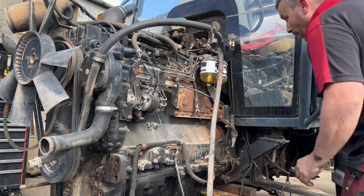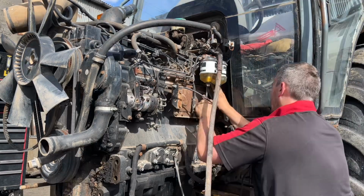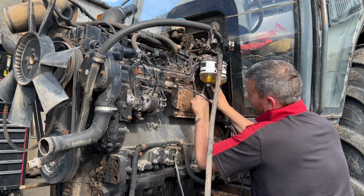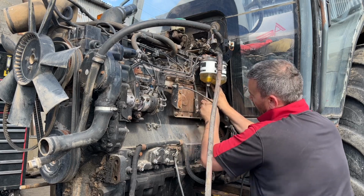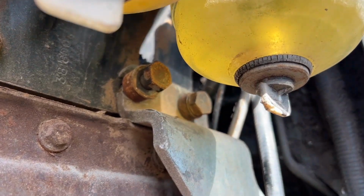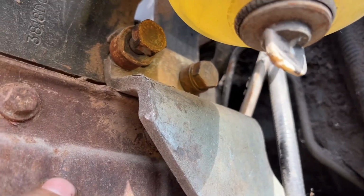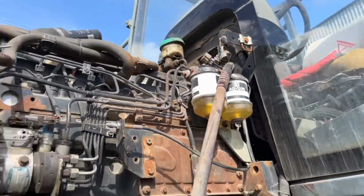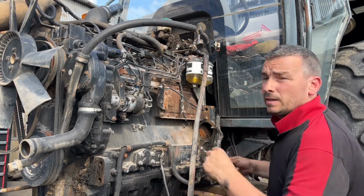Right, we'll take off the bracket here, I suppose. The 17s. Whatever genius was here last, you put the spacer directly behind the head of the bolt. I'll actually show you this. You put the spacer behind the head of the bolt when clearly the spacer is supposed to go behind the bracket to keep the bracket stepped out away from the plate here, but no. Geniuses at work. They're everywhere, lads, not just in Ireland, they're in Spain as well. I don't know whether that's set up that you can see what I'm at, but anyway.